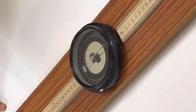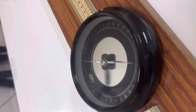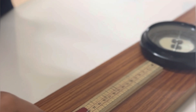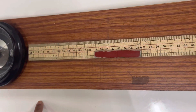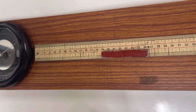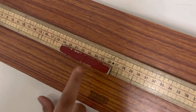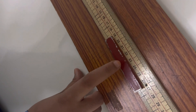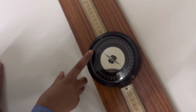Now we can start taking the readings. It is better to take readings from 30 degrees to 60 degrees to reduce errors. Keep the magnet parallel to the arm and move slowly towards the compass to avoid over-shivering of the needle. Move forward until the compass shows 30 degrees of deflection. The corresponding value on the meter scale is noted. The measurement is taken from the center of the compass box to the center of the magnet. The center of the magnet is marked with a line; the value obtained is 23 cm. The corresponding value on the circular scale is roughly 29 degrees and 30 degrees, taken as theta 1 and theta 2.